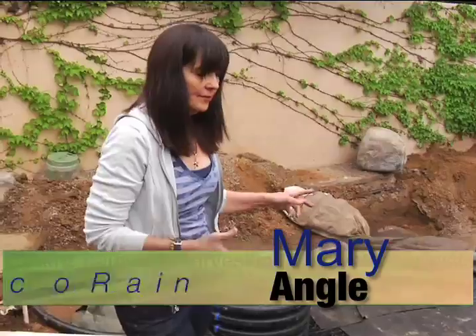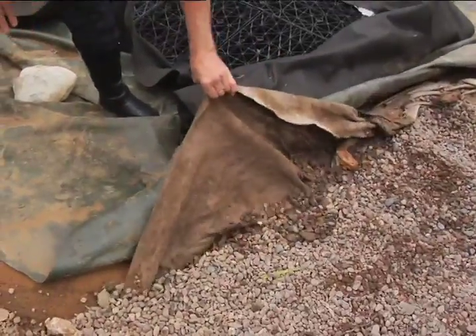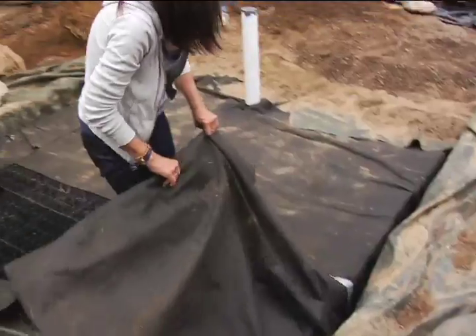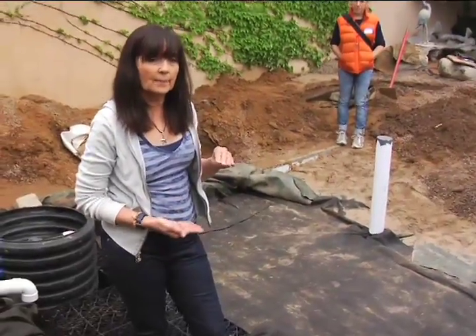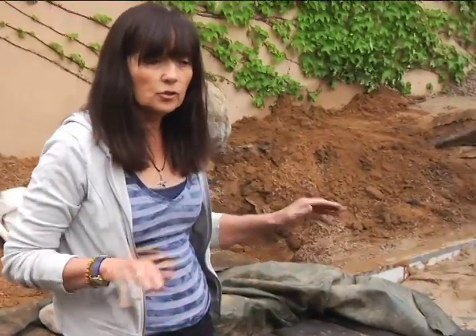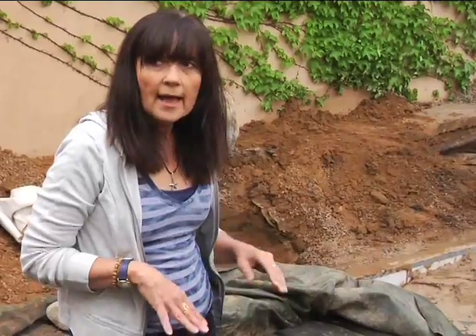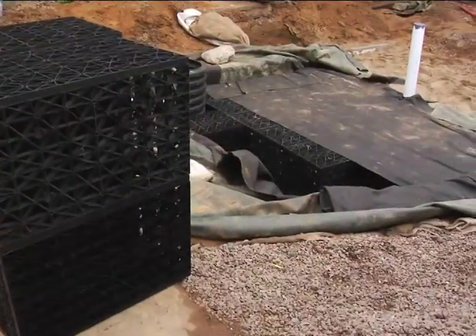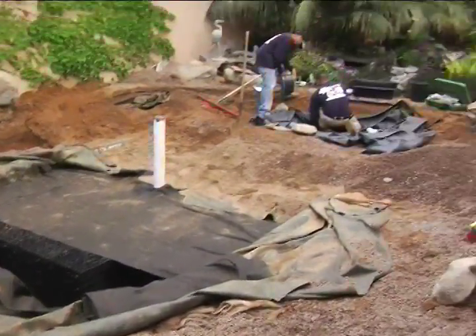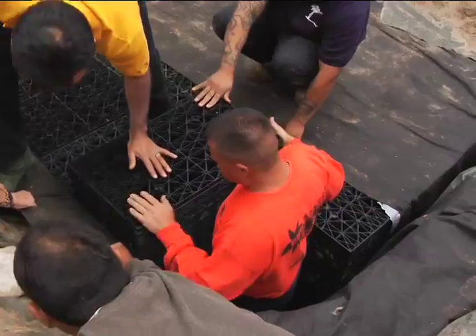The way that this was built is there's the structure that Mike put in years ago. He had an underlayment — this white piece here — that protects it from any intrusions coming in. Once we got the liner in there and cleaned out, we put about six inches of sand in the bottom. They leveled it out and used water to get it compacted. They went in with a two-by-four and leveled it really well with rakes. Then they laid the geotextile fabric in layers with six-inch overlaps. When they start putting the tanks in, you don't need to seal it up or anything — it'll all hold. They put the tanks in and got them in nice and snug.